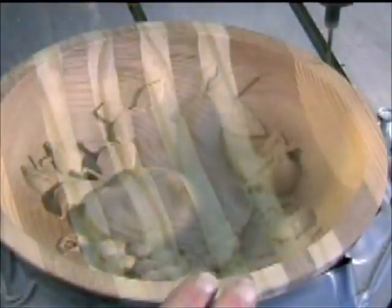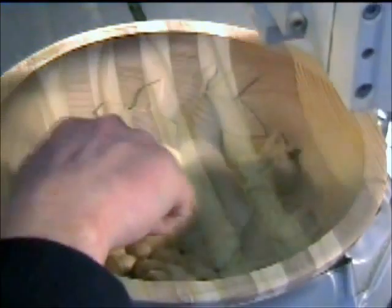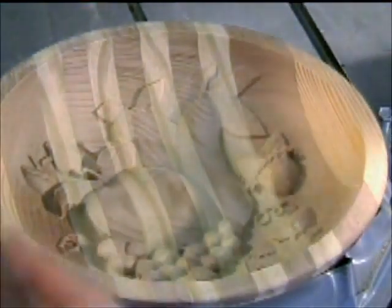I wasn't totally happy with the finish of this — it's left it a little tiny bit furry here and here and on the back. Might have been because of vibration, I'm not really sure. So what I've done is I've reprogrammed to recut this 90 degrees out of phase — so instead of coming back and forth running in the X direction, it's running in the Y direction and doing the same track.